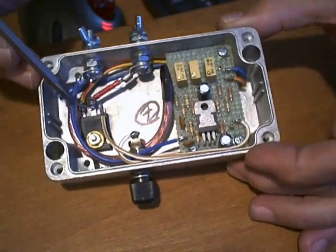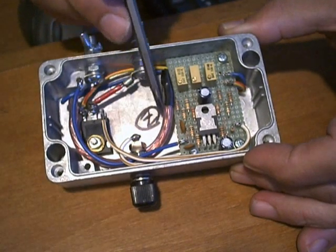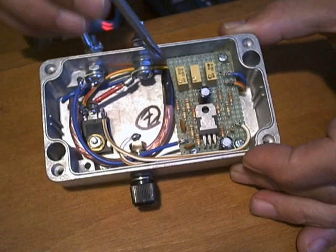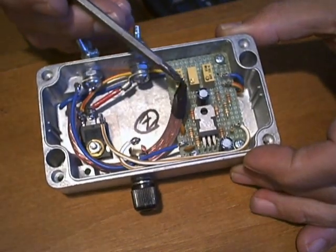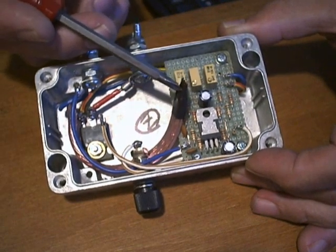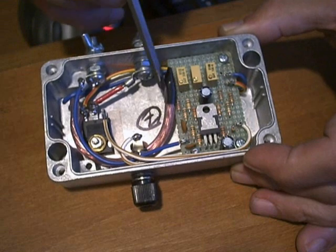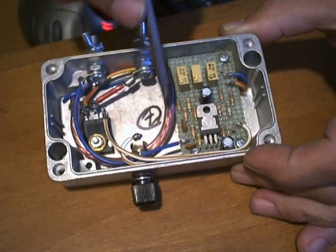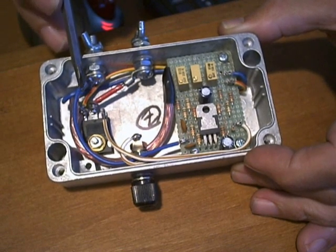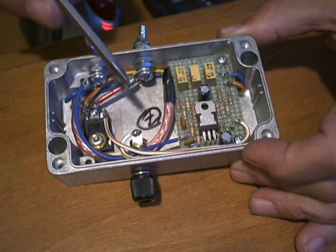I also want to point out this piece of speaker wire — two conductor 16 gauge speaker wire, four and a half inches long in total length. This is R12. On this end I've put a piece of wrapped electrical tape around it, but inside I've taken the two ends, stripped off a tiny amount, and soldered them together. Together they form a nine inch 16 gauge piece of wire going out and coming back to the MOSFET. That is R12. Nine inches of 16 gauge copper wire is 0.003 ohms — that's what we want for our current shunt.